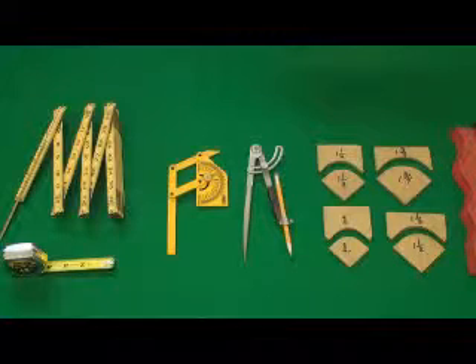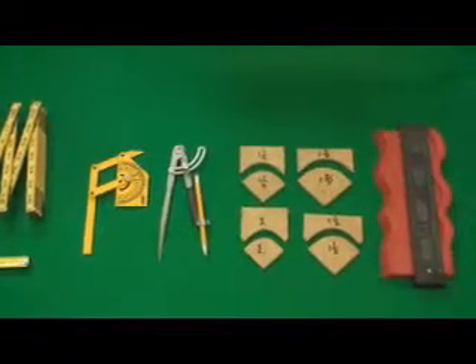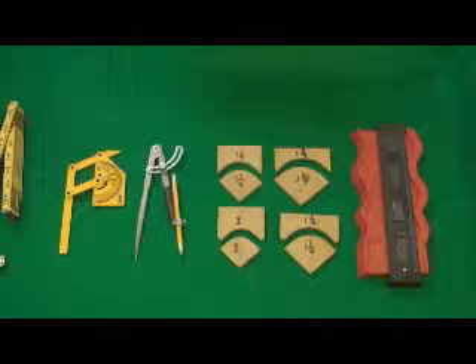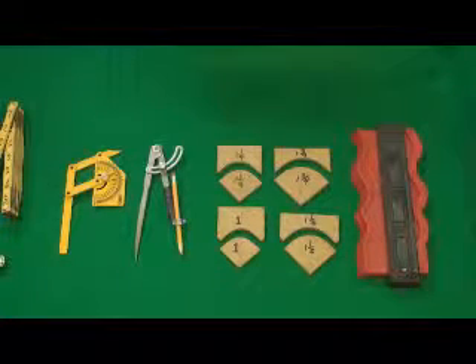Contour gauges that you can cut out of cardboard or plywood — they're great to measure your inside and outside radiuses accurately. And an adjustable contour gauge that you can just push up against the object and get almost an exact duplicate of its shape, which can easily be transferred to most of your drawings.